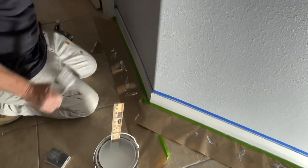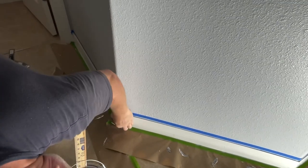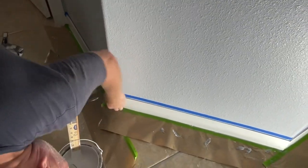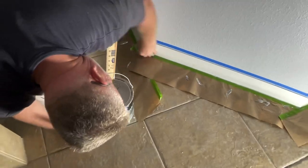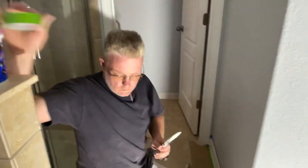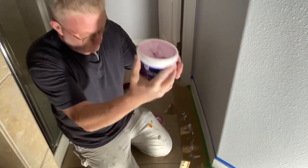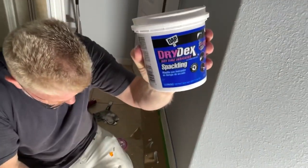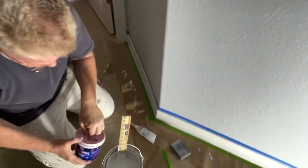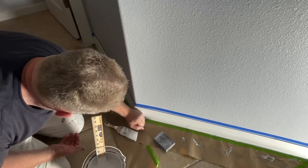There's my little two-inch brush with which I'm applying it. There's my sander. I just simply scuff up the trim to make keys — little marks in the surface so that the new paint sticks. There I am using Dry-Dex, and that will fill in any holes or dents that are in the trim.